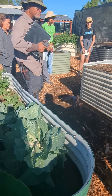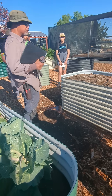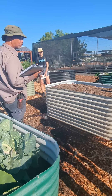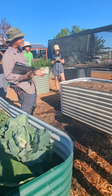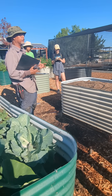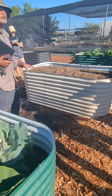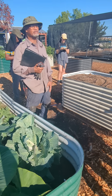That's where I got the clay clumps from. The clay has been compacted to the point where the water doesn't percolate. What you're going to do at your homes is plant trees. Whenever we go to plant a tree, we make a hole and throw a gallon or two of water in there and measure the time it takes to clear, because that tells us the percolation rate and whether roots can penetrate the soil. But this has been sitting here for a week and has not percolated through because the soil is hardpan clay.